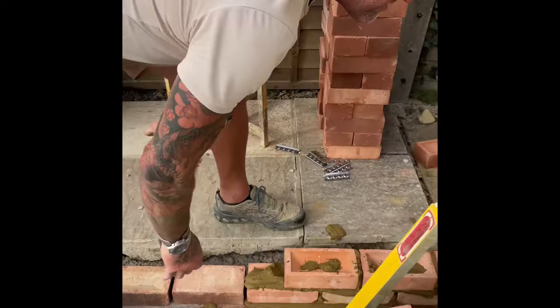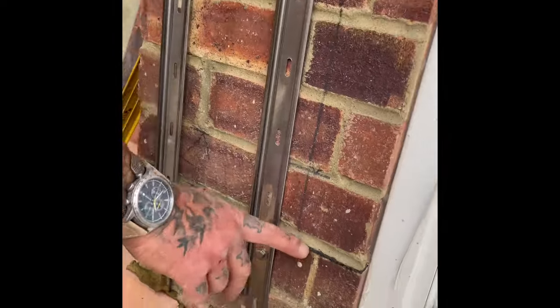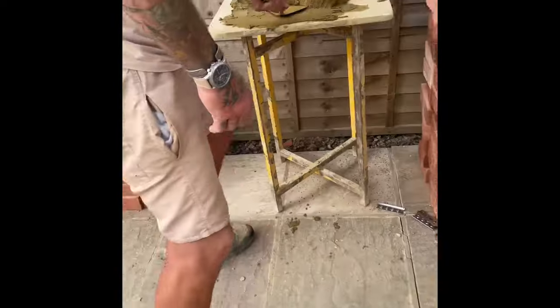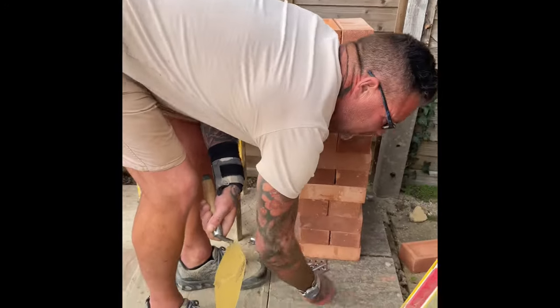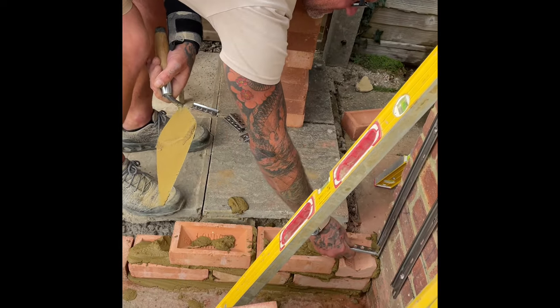What we're gonna do, boys, we've got 5 courses, we've got to raise the damp course here. Damp's there, look. We've got a par damp here because the floor in there is coming up. So we'll get it up to damp and then the profiles will go up. Wouldn't they, Dennis? They will indeed.